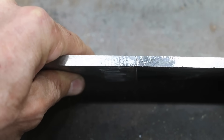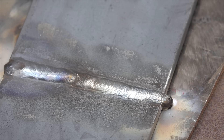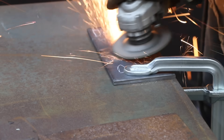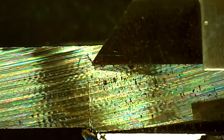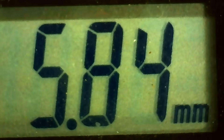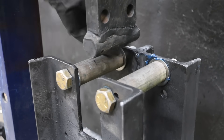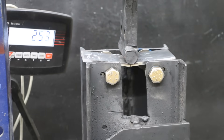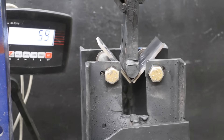Let's test maximum penetration on quarter-inch by four-inch mild steel. All welders run at maximum power using 1/8-inch 7018 rod. The S7 started cold but improved after a few seconds; it's only making about 113 amps — not nearly enough for good penetration. After grinding the weld flush and cutting away one inch of the test coupon, the S7 showed 5.84mm of unfused material — total penetration of only about half a millimeter. The test jig uses outer rollers with a plunger pressing down until the weld breaks. With only 0.5mm penetration, the S7 coupon broke at just 287 pounds.